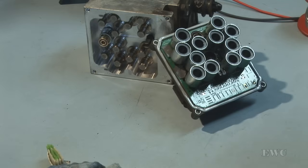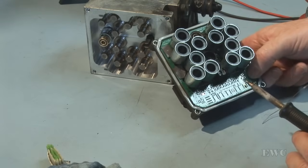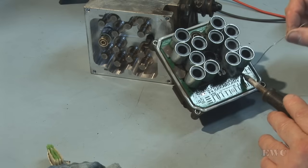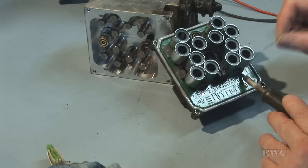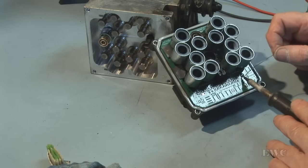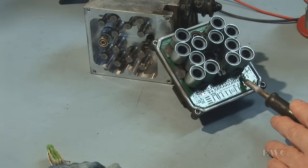Okay. Likewise with these pins, you have to make sure that the solder actually gets through down to the multi-layers, so you have to give it a bit of time to get down there. First of all, I'm going to do these earth connections here, four pins each side.